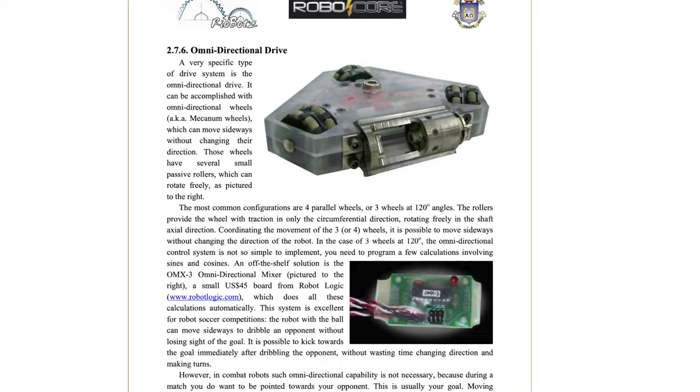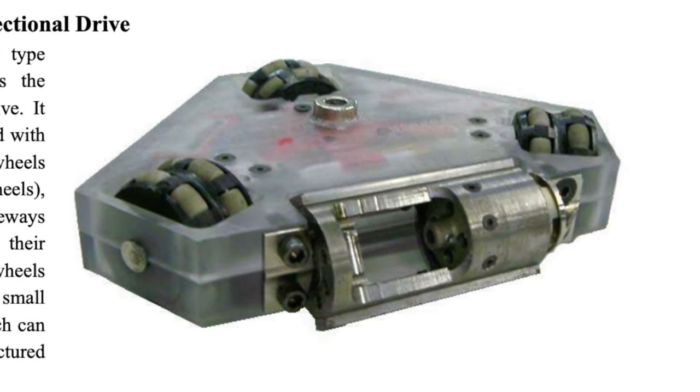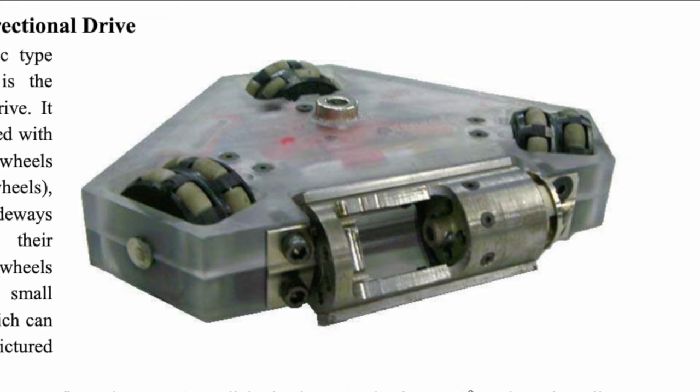When looking for inspiration for my own machine, I stumbled upon this photo in the Riobots combat tutorial document. It depicts an unnamed robot with a three-wheel Killough drive in a two-piece clamshell chassis, fronted by a hub motor egg beater weapon. This machine is invertible, it has protected wheels, it has a decent looking weapon, and provides a solution to the complex chassis problem with those two assumedly machined pieces. The three-wheel Killough is also the lightest of the considered Omni drives, so I chose that it was the best basic concept to move forward.